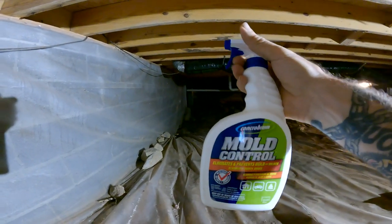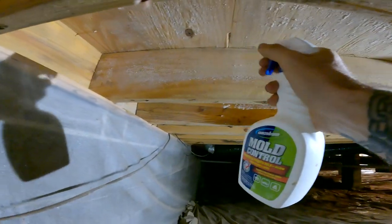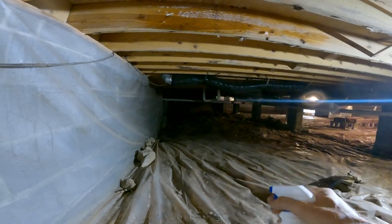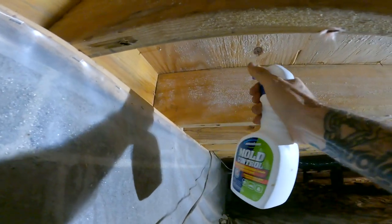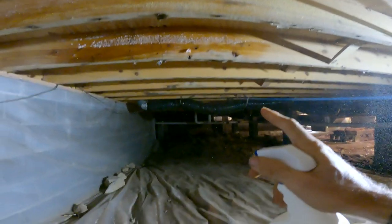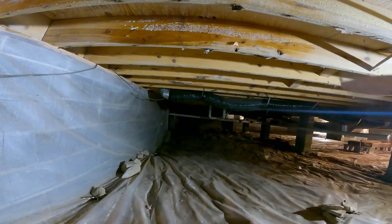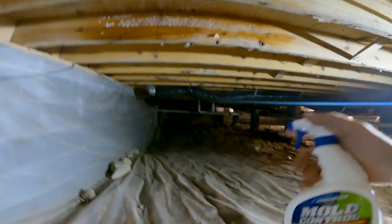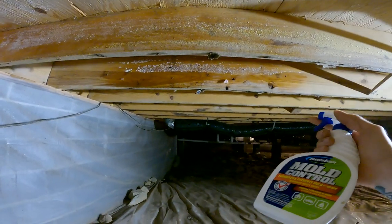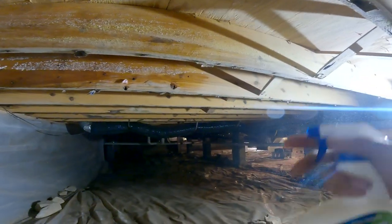So I started researching what exactly this does. What bleach does is — bleach is basically just two ingredients: water and chlorine. When you spray it on, the water immediately soaks into the wood and the chlorine, which has a really high evaporation rate, flashes off really, really quickly. It kills the stuff on the surface but doesn't sink into the wood. Mold spores and all the little tendrils go deep into the wood and then they just flower again, because what you see on the surface isn't what's actually inside. So effectively, if you use bleach, you're feeding it — you're making it worse, adding moisture to what's inside and it's just going to continue growing.